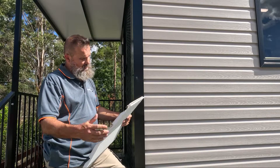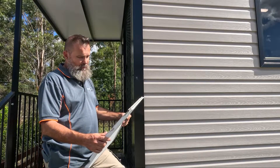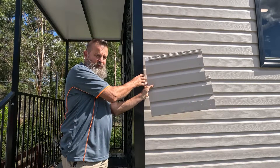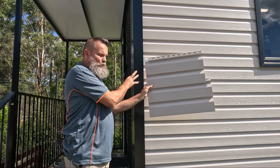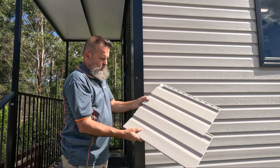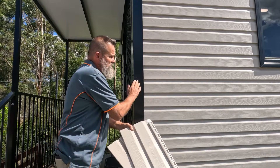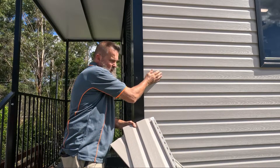On a van home, can they service the cladding? Yes they can. Generally we advise a contractor does this for you. However, essentially the cladding goes under a flashing here. If the flashing is removed, this cladding can be popped at the seam and split down, access can be gained, and then it can be pushed back into place.